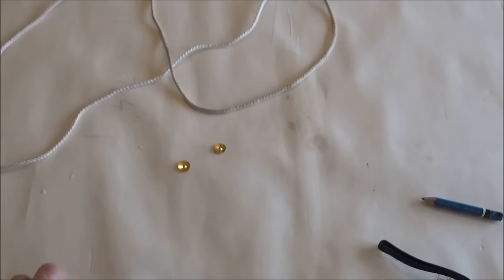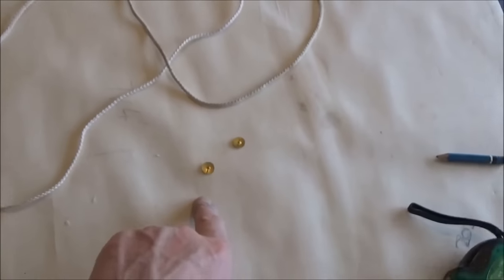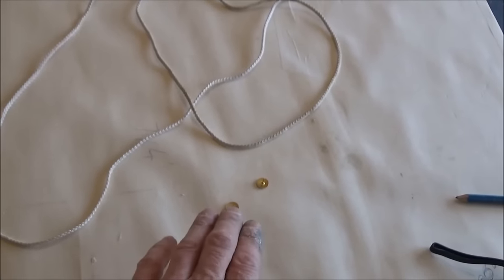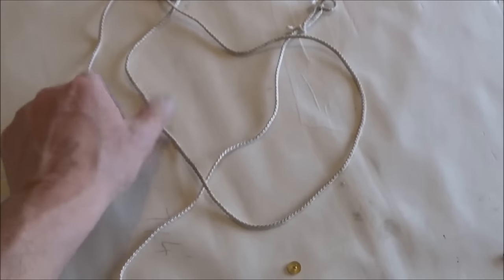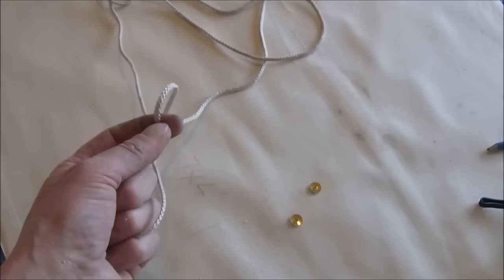So what I'm using is a couple of drawing pins. You can use little tacks. Sometimes it's better if the plaster is a bit weak. And I've got some string. You can use a snap line. You can use anything you want, really, as long as you can get a straight line down the ceiling. Okay, the string's up now. You can see that there. And what that ensures is you get a perfectly nice straight line when you've done your pencil mark across the ceiling, because you can't use the spirit level with it being up there.